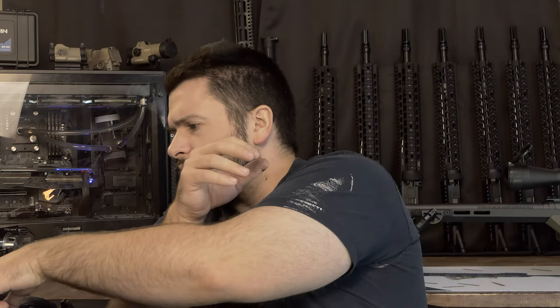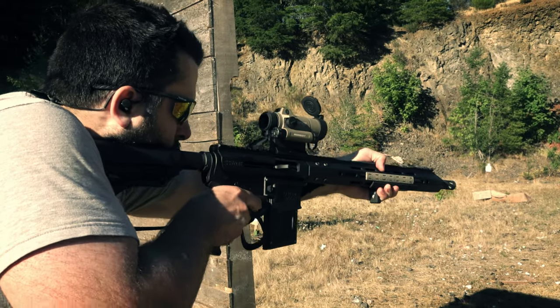This is not the only thing it takes to run the system. If you drop this BCG and upper receiver onto a lower with a standard carbine buffer and spring, it will not function whatsoever. The way they've gotten this system to run is with an extremely long and lightweight buffer — there is nothing inside of it, weighing somewhere between two and a half and three ounces — and a very, very short spring. This means you have something to stop the bolt from over-traveling that is very light, and you also don't have a lot of spring tension, which allows this blowback operating system, relying on the power of the ammunition itself, to cycle.